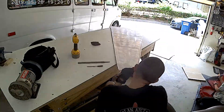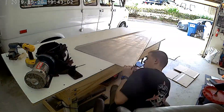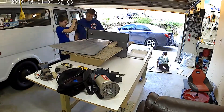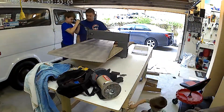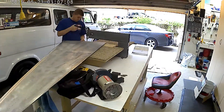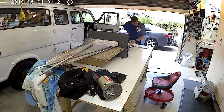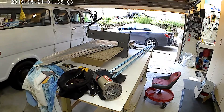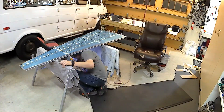So here I'm prepping the bottom skin. It's really interesting to see the way that Vans builds in their technology — there's essentially a J channel built into the skin, which is super cool. And then dimpling with the kids: I've found it's the one thing the kids can do and they seem to enjoy doing. Small hands are great for loading rivets into a skin. So here I'm probably prepping to prime — I found one J channel that I had completely forgotten to get down and dimple. Maybe you'll see me go back and do that. But anyways, we're on to riveting.